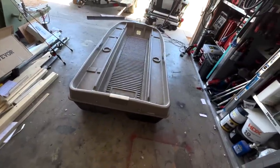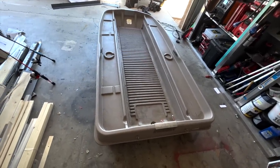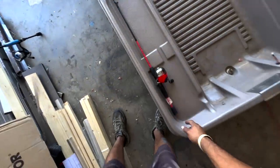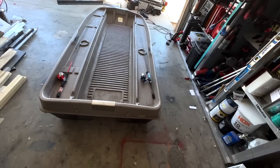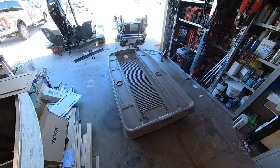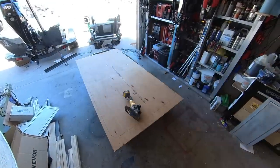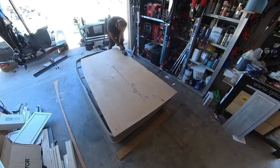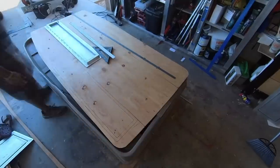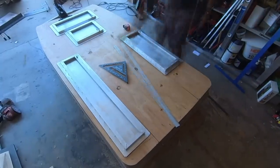We're not going to chop the body up — I thought about doing that but I think that's a stupid move. We will just convert right to the frame. We can add a nice little core section and even add a section where we might be able to have some rod locker utilization. There are high enough sectioned-off areas; we can have quite a few compartments. We're going to use one half-inch five-ply sheet of treated plywood from the hardware store. If you can find marine-grade plywood, good for you; otherwise this will do. We're going to be turfing this entire thing and installing flush-mount dry hatches — these are our ultralight dry hatches, which are lighter and cheaper than the standard robust hatches we use for bigger boats.